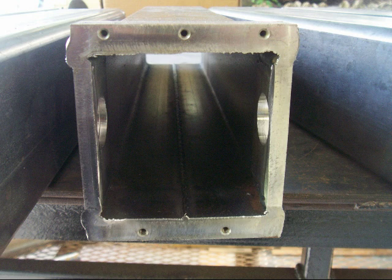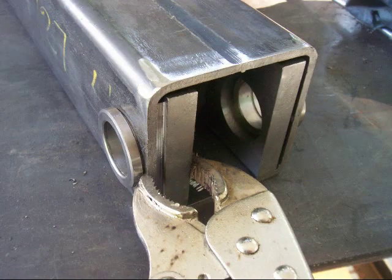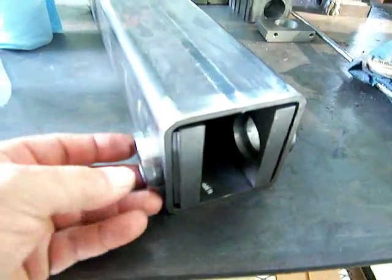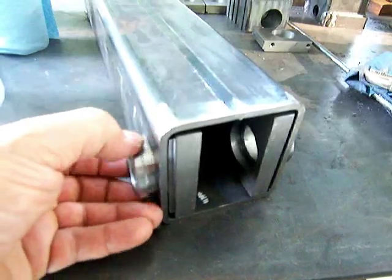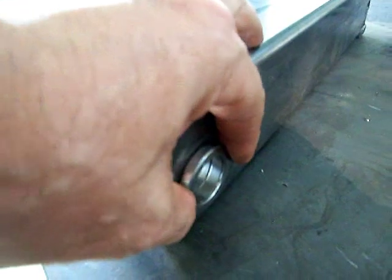What we're going to do is put the other end on this thing. There are stiffener bars that go on the other end where the drive motor mounts up inside. It's a really powerful motor, so it has to have some stiffener plates welded inside — otherwise it will actually torque this 3/16-inch wall tubing and it doesn't work right. These stiffener plates are about three-quarter inch thick, milled out with a hole drilled in them, and the bosses get welded in there where the drive axles go through. The motor mounts up inside and the bolt hole pattern has to be good when they're all done, otherwise the motor won't mount up in there.